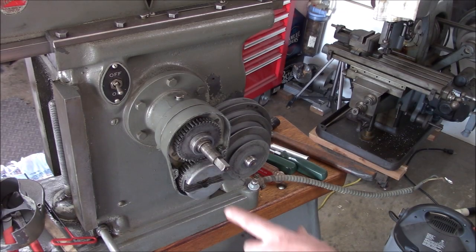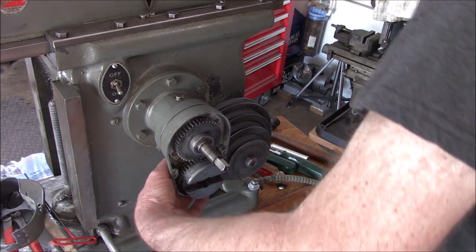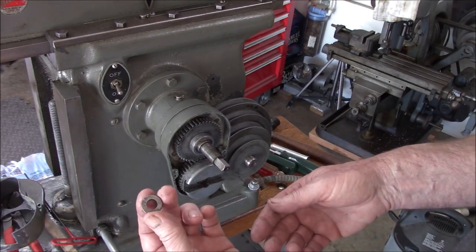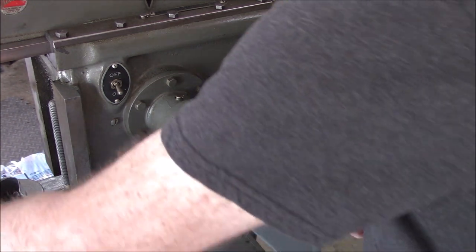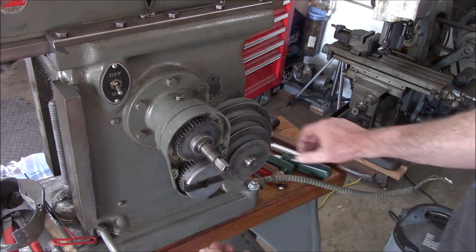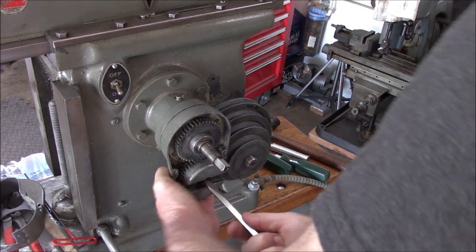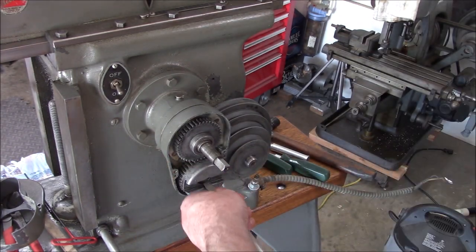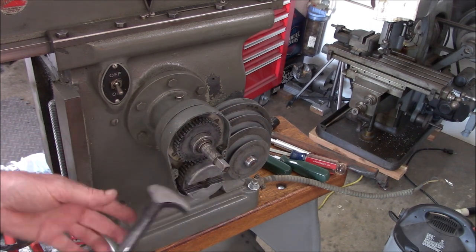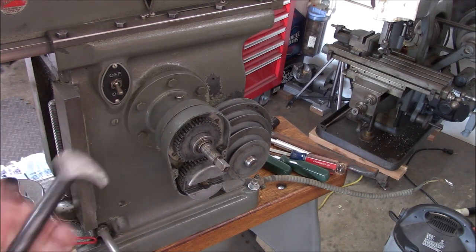Then I had to come in with a punch and just tap back and forth until I got that T-nut to move. Once you get the T-nut out, you've got a pivot bolt here in the center. On the back is where one of the linkage rods attaches. There's a bushing — if you didn't take it off with the linkage rod, you need to take that off now. Then that screw's got to come out. It's held in there by a little bit of friction and a close fit. Be careful — this is an aluminum housing so don't put on too much pressure. I got a heel bar against the body of the machine against that bolt, and just a little tap is all it takes.